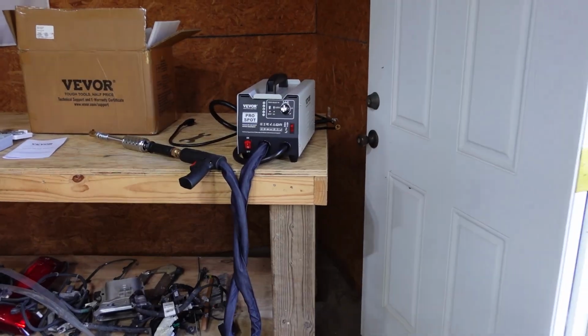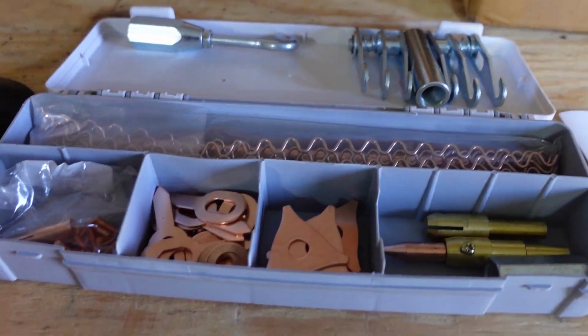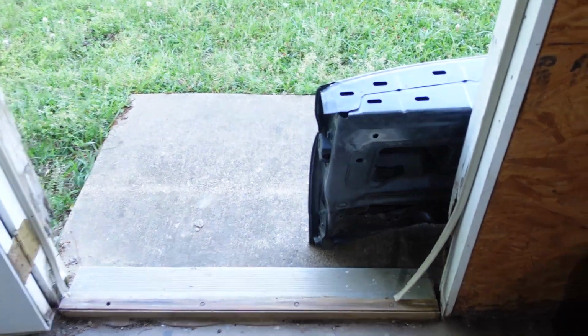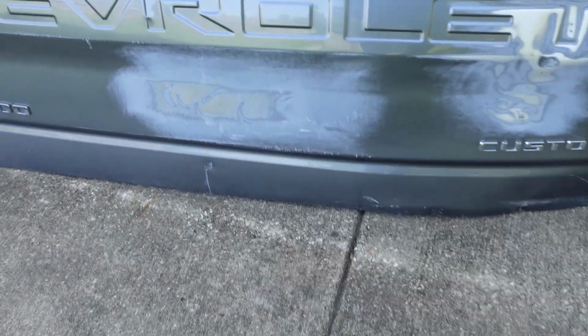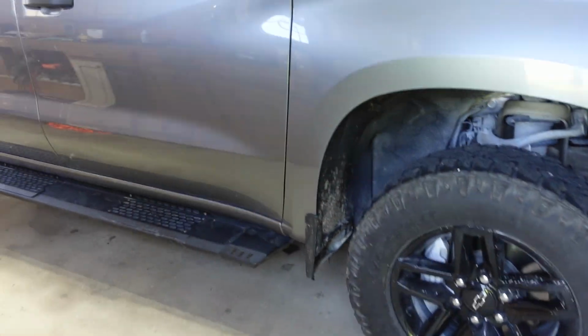At the end of the last video we did an unboxing of the VEVOR stud welder dent puller, and in this video we're going to test it out. So this is the stud welder dent puller. We did all the unboxing and I showed you all this, but it was at the end of the last video, so I'll kind of go over some of that again. But we tried it out on this tailgate, and I didn't realize that the tailgate was aluminum, so you can't do any kind of stud welding dent pulling on that. It has to be a ferrous type metal.